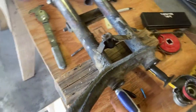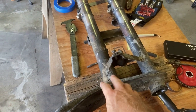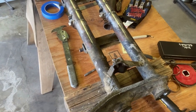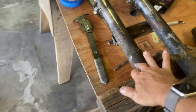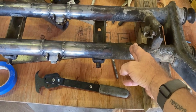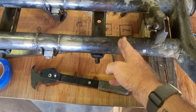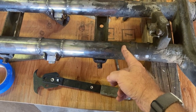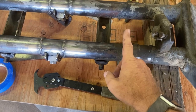Now I'm going to pull the seals. I'm not going to worry too much about how much grease is in there. I am going to measure back to find the bushing — I think there's a nylon bushing somewhere back in here. I want to figure out how deep in that goes, and that's going to give me a 'don't cut before that amount.' And then hopefully an inch inside of that, so let's say the bushing goes to about here. I'm going to go at least an inch here, if not more, so that the sleeve does not butt up against the bushing.